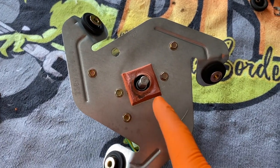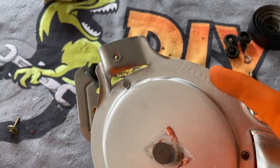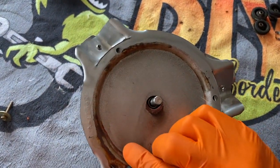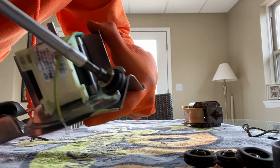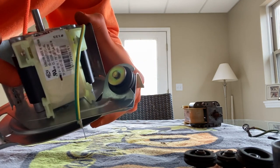After securing the three screws, you've got an arrow in the bottom right-hand corner — go ahead and align your plate. The part number is on the front and on the back side; the part numbers will actually meet. Slide the plates into place and secure them together with all of your grommet gasket screws. As you insert and secure these, do your absolute best not to over-tighten them — you are screwing into aluminum.